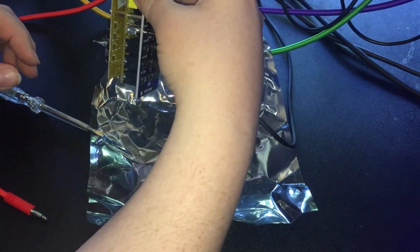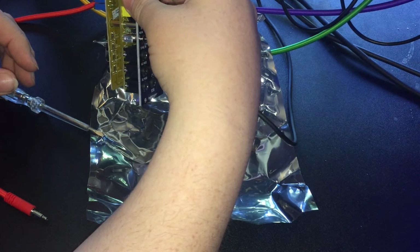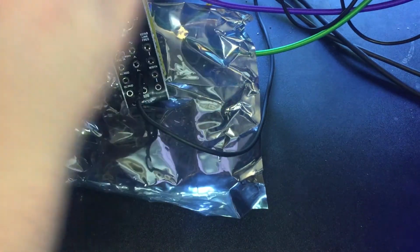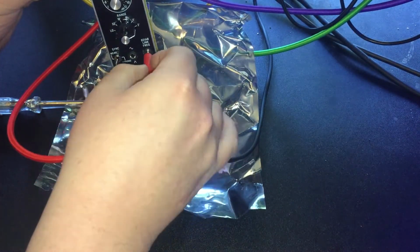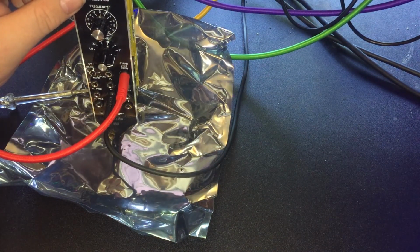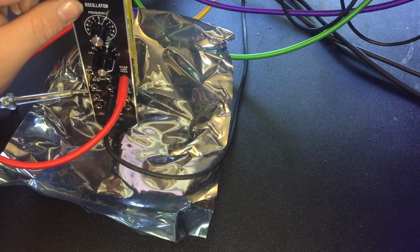Exactly 640. Right, fine tune the 921B oscillator's low frequency scaling via the following steps. Make sure the frequency knob control remains at 0. Yep. Apply exactly -2 volts at the link frequency input. Turn the scale trimmer to set the 160 hertz, which it's already at, 160 hertz.